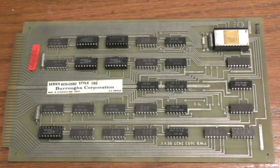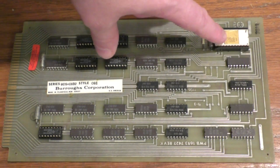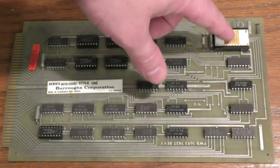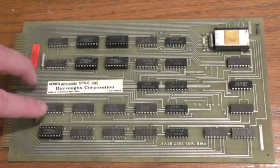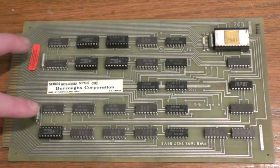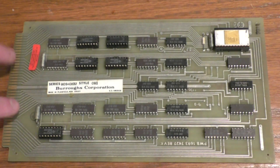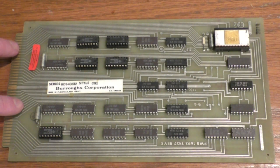Here's the next board — this is the graphics board. This is the character ROM; it holds the 64-character font and uses an MK2301. The six-liners and one-liners each have their respective chips. The rest of the chips are basically a lot of flip-flops acting as latches — there are eight sets of latches that latch one column of each of eight characters. They're then fed in parallel to the display board, where they're driven onto those really small wires I showed earlier.